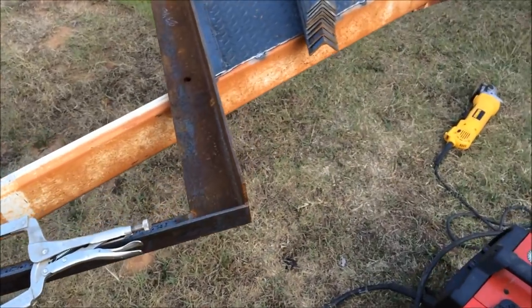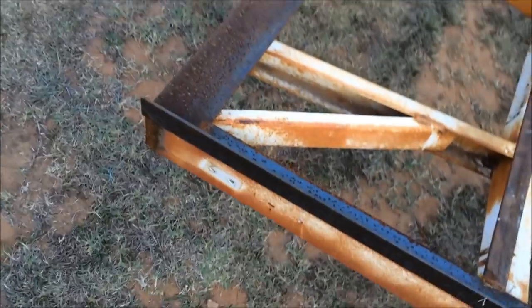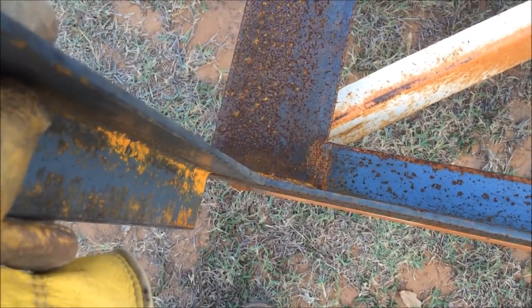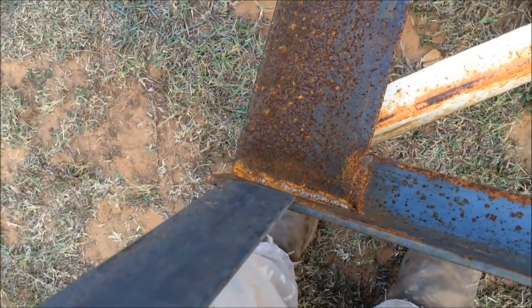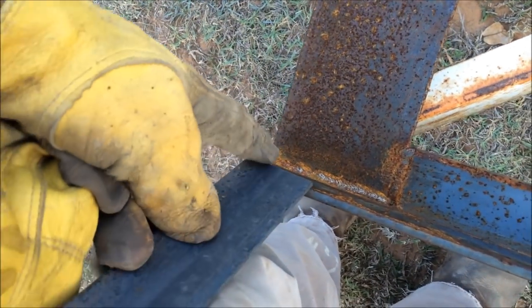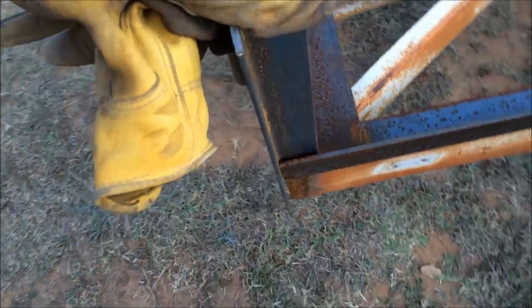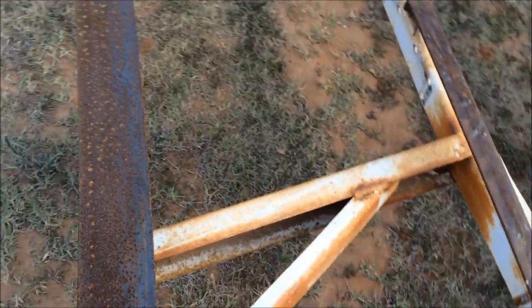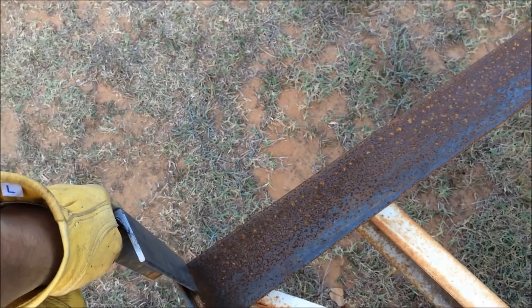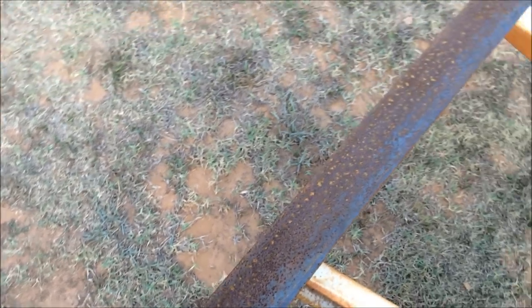This front corner piece is actually going to be sitting in here like that, if you can see that. And this back piece, I'm going to notch out, so I'll cut this corner, it's hard to do this just one-handed. I'll notch this out right here, and it's gonna sit flush just like this. That is mainly because I'm probably gonna weld in a 1.5-inch channel in there to drop a 2x12 in there as like a tailgate.